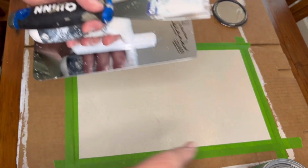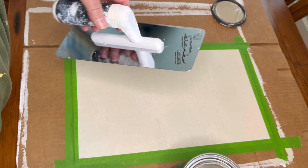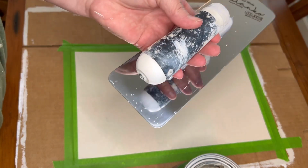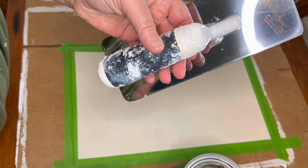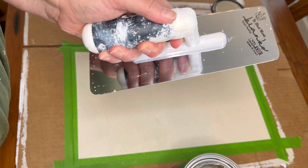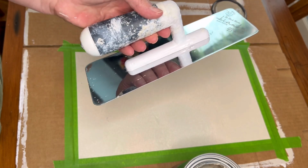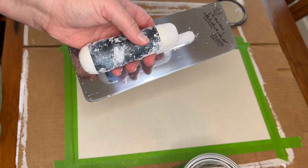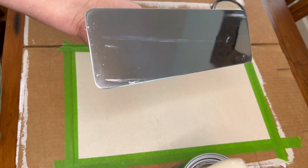Just want to make sure everything's okay. So I'm taking a little putty knife, and I'm using this Italian trowel, okay? This one is called Bianco. This particular one was made specifically for very light colored plasters because it doesn't mar the surface. You know, sometimes metal will leave little gray marks. This particular trowel won't. So if you're doing a dark color plaster, you could use other ones, but this is the one I use when I'm doing really light colors, okay?